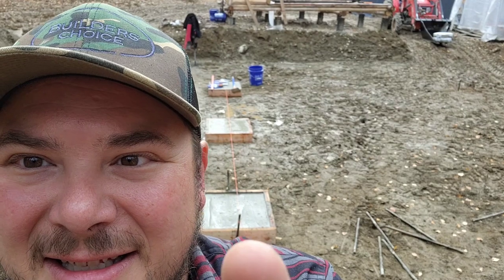And there's the back, in the middle, this is the other back corner right behind me. The middle of the cabin will be right about where that stake is lying crosswise right there. So now I have made sure that this measurement from this stake to the spot in the middle of this pad, and from the middle of that concrete pad with the cup over to where that stake is, are identical measurements.